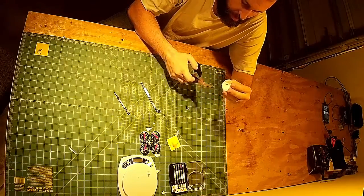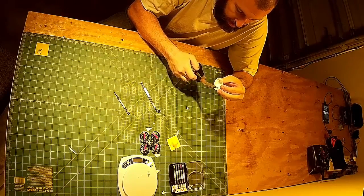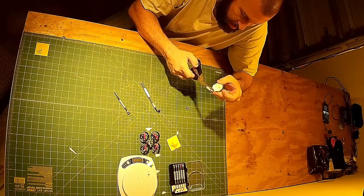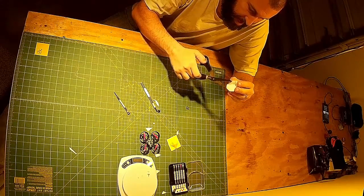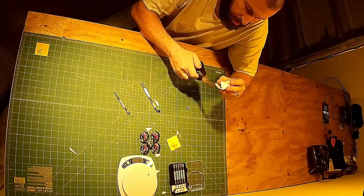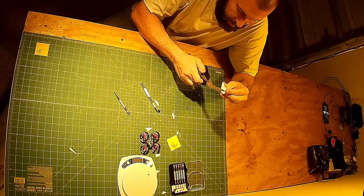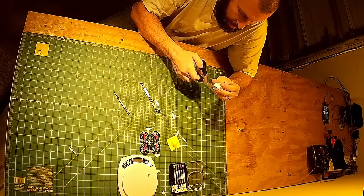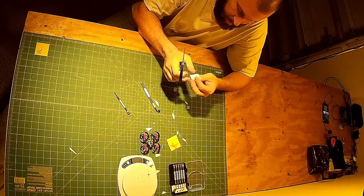If you start like this, the easiest way to deal with this curve is you're coming right in on top of this cut line from this angle at 90 degrees. Same thing right here, laying this part of the blade right up against the back of the canopy. That helps keep it lined up. And one nice swoop, comes right through. Down to the front, right at 90 degrees. Last one, right at 90.